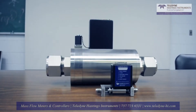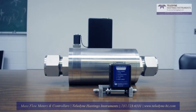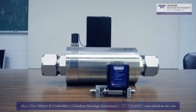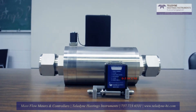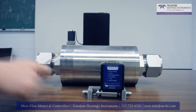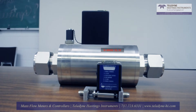Next, we have the flow bypass, also called the shunt. Teledyne can take this 300-style flow sensor, and by changing the size of the shunt and the body of the flow meter, we can configure to measure flows in the range of 5 SCCM, which stands for standard cubic centimeters per minute, all the way up to 8,000 SLM, which stands for standard liters per minute. A 300 series thermal mass flow meter always includes a flow sensor and a shunt.